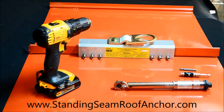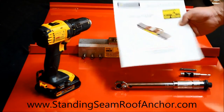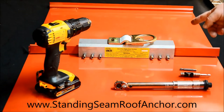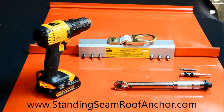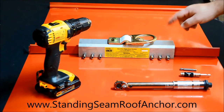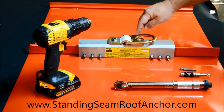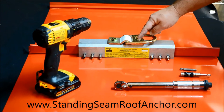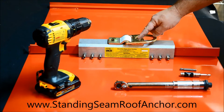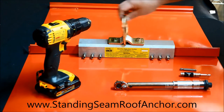So by now, you should have already read your owner's manual cover to cover. You should have already got the anchor into service by doing your first use data, doing your initial inspection. Part of that includes these two top bolts. You want to check torque on these before every use. These are 9/16 inch, and these need to be torqued to 90 inch pounds minimum, not foot pounds, 90 inch pounds. Same as these cup tip set screws.